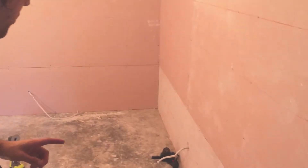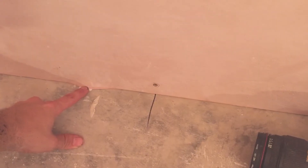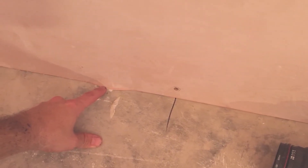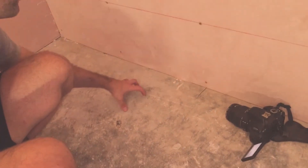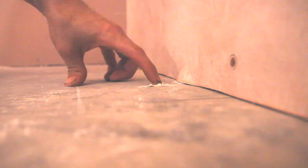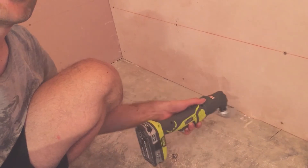Here's the first little problem. When we were putting in the lower wall sheet here, we were trying to keep a little bit of a gap so that the sheet didn't actually touch the concrete. But we have a problem where there's a bulge. I think there must have been a little bit of material or some object under there when we put the sheet down, and this bit here bulged out. Because it's pressing so hard against the concrete, this wall is no longer isolated from the concrete — it's connected. I've got to disconnect the wall from the concrete again before it's going to be soundproof. So I'm going to use a little multi-tool and cut a few millimeters gap all the way along.